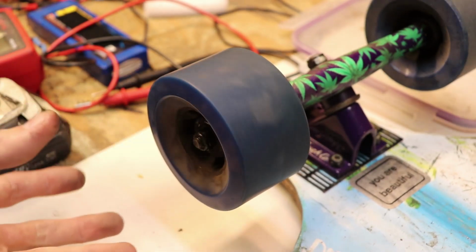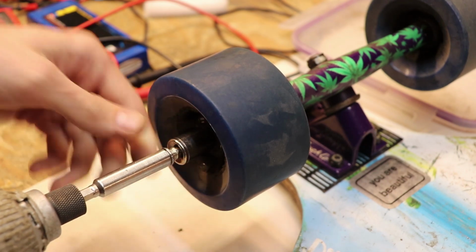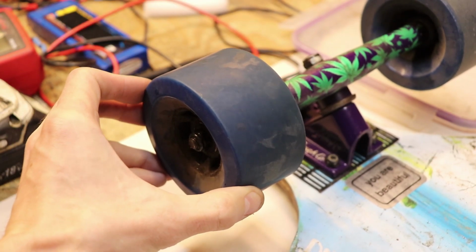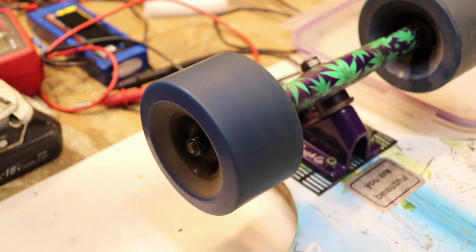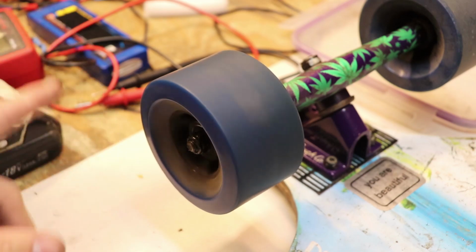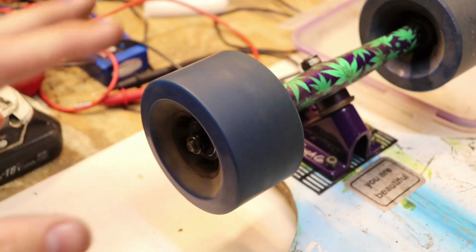It's actually being slowed down a lot by how tight I put on the nut. So I'm going to unscrew this nut a little bit. Oh, and now I can feel that the wheel moves from side to side just a very tiny bit. And now, look at the improvement that we made to how this wheel spins. Now we have successfully installed the wheel.